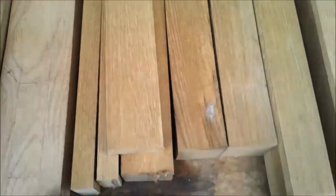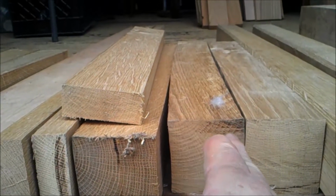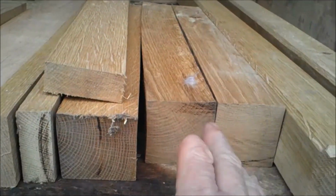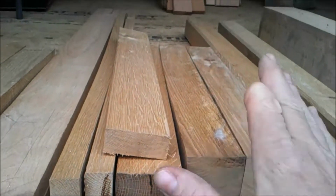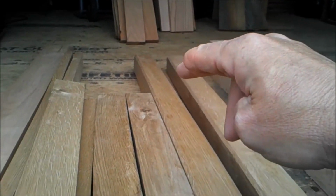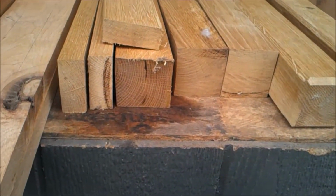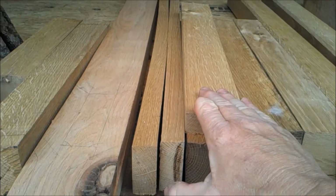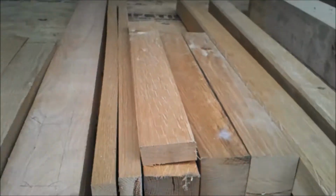We'll need a couple of cross beams, and I don't know if you can see the warpage that has taken place in there. I mean, look at the gap. It's closed here, opens, and it closes down there. These have warped pretty significantly. So like I said, we're going to remake them. One will be for the upper part of the beam, one will be for the lower part of the beam where the juice pan sits. So then we would have the front legs and a lower front cross support for the juice pan to rest on. Now, let's take a look at that real quick.